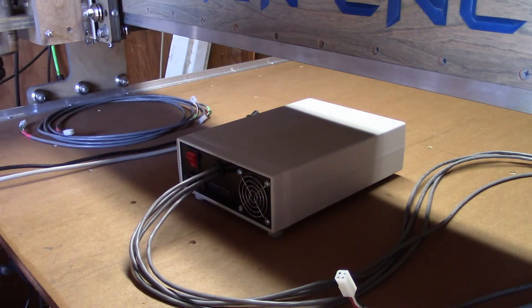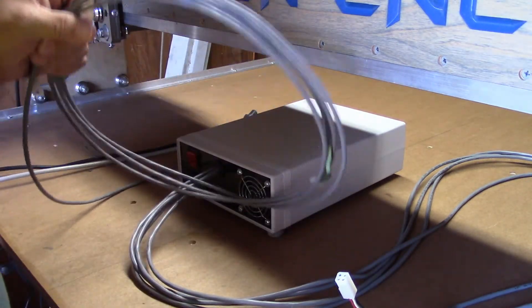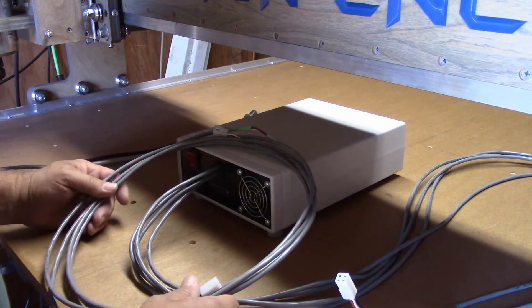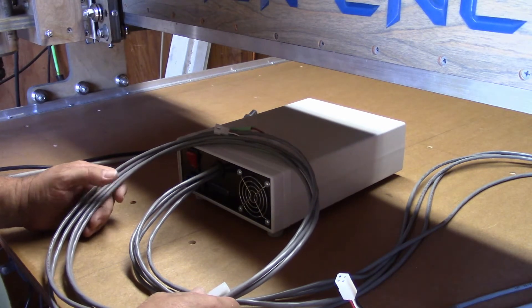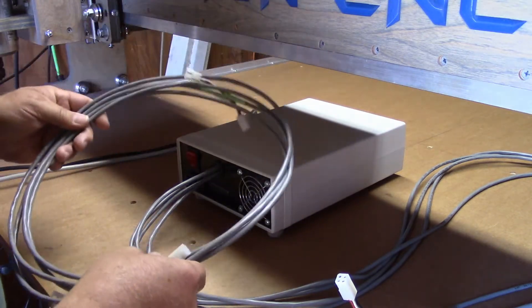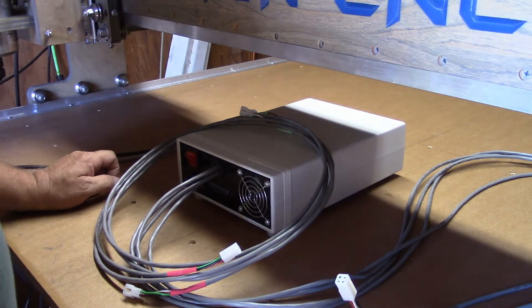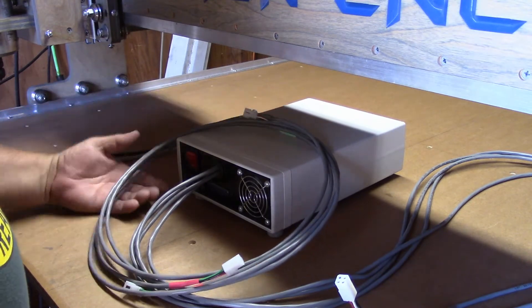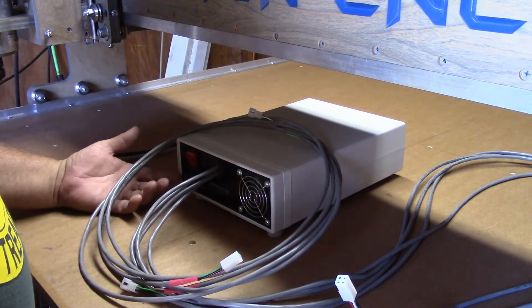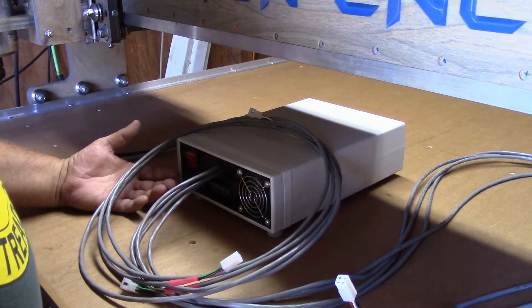Because of the size of my machine, I went ahead and ordered six-foot extension cables. I kind of went a little overboard — I got trigger happy online and got the whole set. I probably did not need the extension cables for my Y axis, because the Y motors are fixed and don't move at all. But I went ahead and ordered the whole set while ordering some other things from Jeff over at Xylotex, because it just wasn't all that much. If you're in a position to make your own extension cables, go for it. The only thing I'd suggest is to make sure you use shielded cable, to block out interference from your router or any other electrical equipment, especially motors running in the shop.